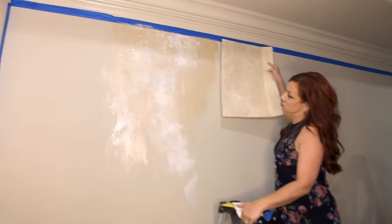Wait until you see what this looks like when you pull the tape away — oh my gosh, this is my favorite part. Watch. Love this. I need to tell you this little trick though — there's a way to pull tape and a way not to. Pull up the corner and you want to go at a 45-degree angle away from the wall. Anything else could mess it up and cause your finish to tear.